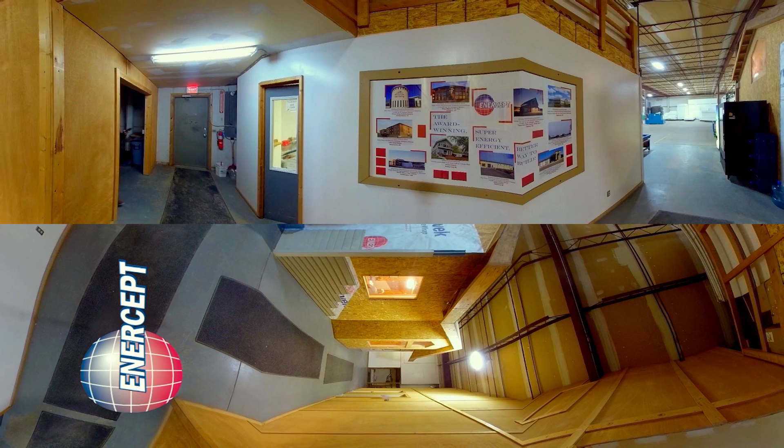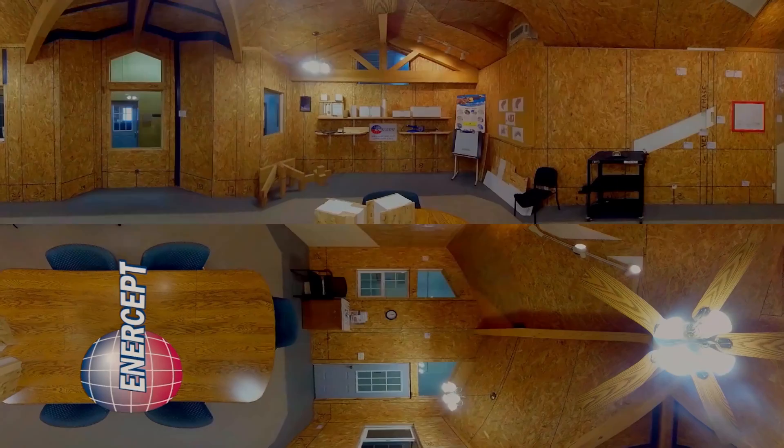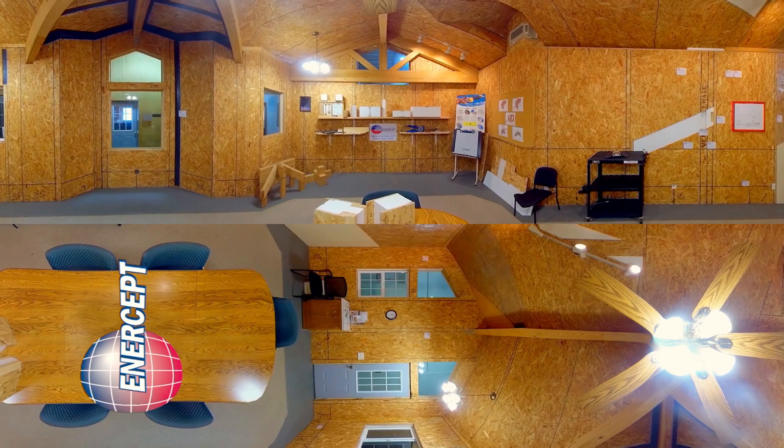To the right is going to be our show home — it shows our product in use. If you look up above you, it's going to show that you can either do an insulated overhang, or a ladder frame, or an outrigger. So it shows off some of the features and benefits of our product. This building is 16 feet wide, 24 feet long, with 9-foot walls and a 6/12 roof pitch. It's a lot bigger than it looks just because of the vaulted ceilings, which is an added feature of our SIP panels.